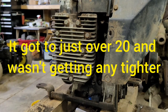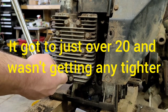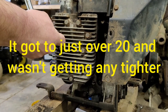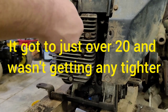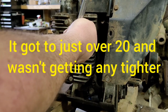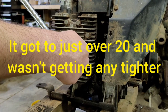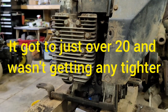That's an unfortunate series of events. Thirty-five. Must have been the weak one when we took it out. 35. One take. 25. 35. 35. 35. Okay, we're all at 35, except for the one that broke off at 20 pounds. So obviously it was a bad bolt anyway.